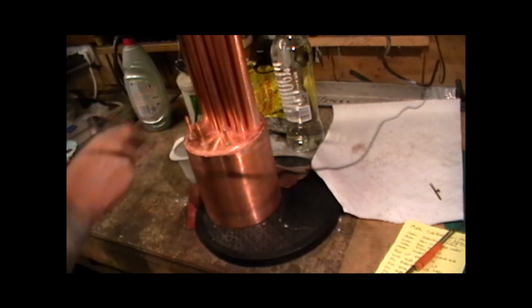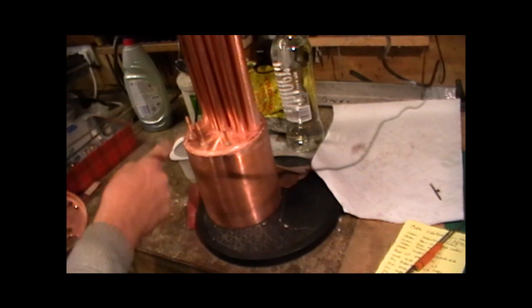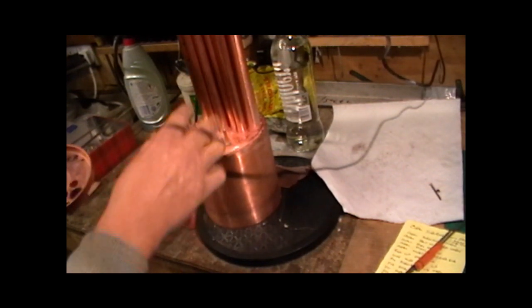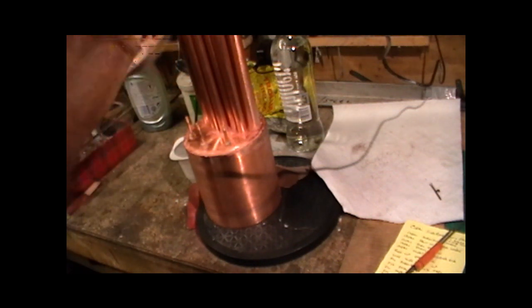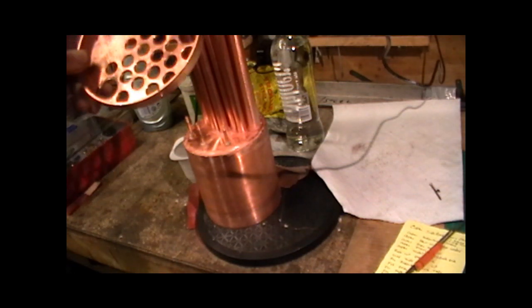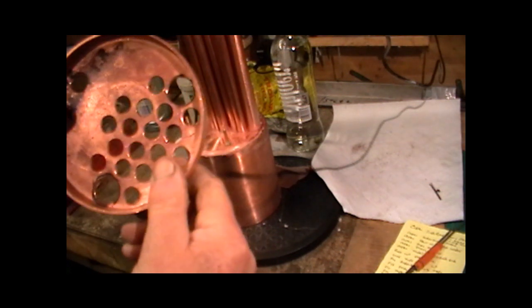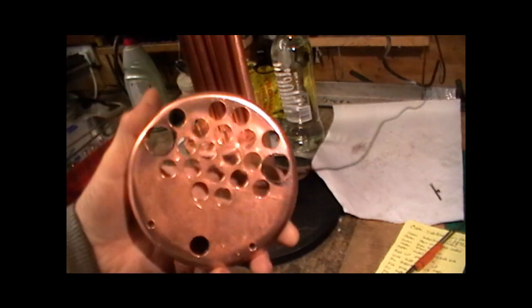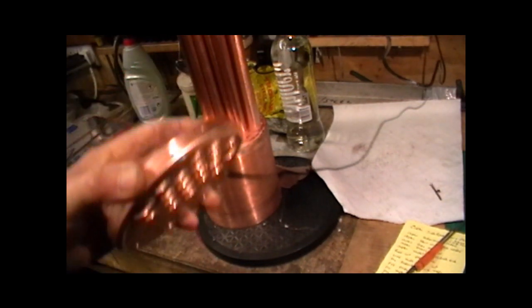So what I've got to do now: I've got my screw rivets in, I've got my stays in, all fluxed up. I've just got to thread this top tube plate on. You can't quite see, I'm out of shot on top, but this is going to go on top, just to keep all the tubes lined up and in position while I solder the bottom. So that's just there for a guide, or it will be when I've threaded it all on.